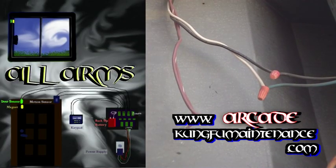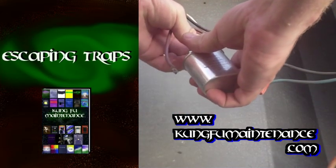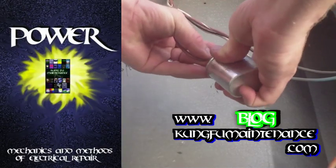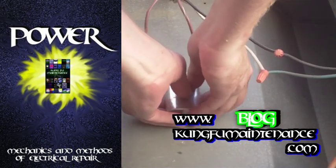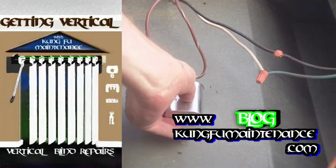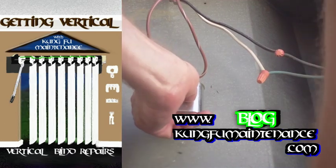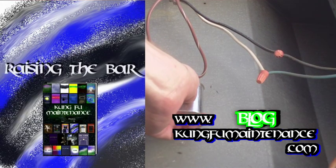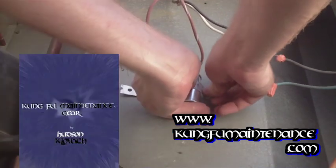Now what we're going to do is make a place to mount our new capacitor. I've got my new capacitor here — we're going to hook this up. We really don't want this just hanging there free. It's a little bit better if we can mount this. What I have is some plumber strap and some self-tapping screws so that we can hook this up a little bit better and make this a little bit safer and easier for somebody in the future.